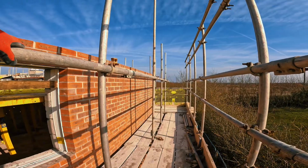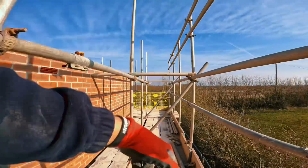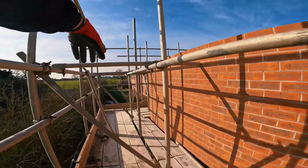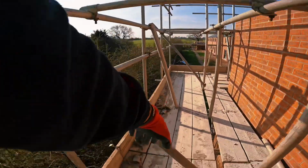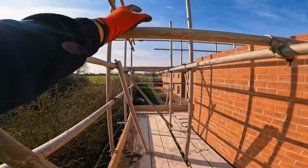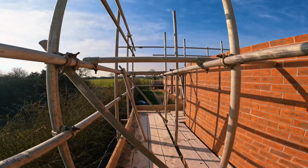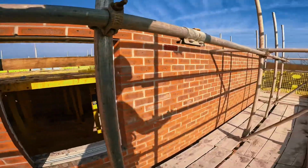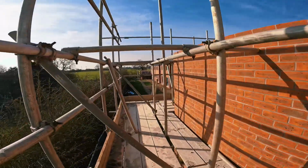1 transom, let's have you. Right, braces are all in, single transom at each end, just to give myself a bit of room. I'm going to fill this in now, undo the clips as you go, clean the scaff as you go in, pull it all towards you. If there's anything remaining, chuck it up, ready to snag the job off. Start pulling all the fleets up. Keep the process going all the way down. That'll be 1 gable done, like that.